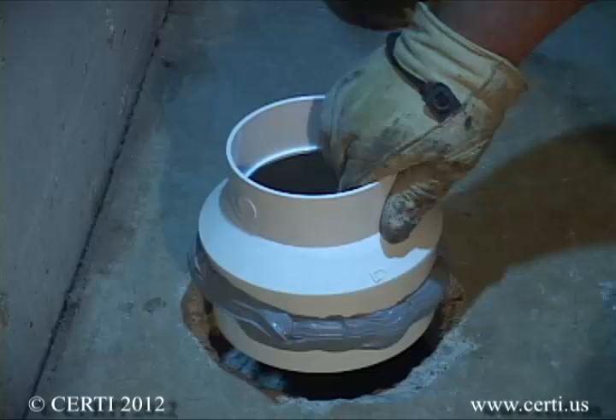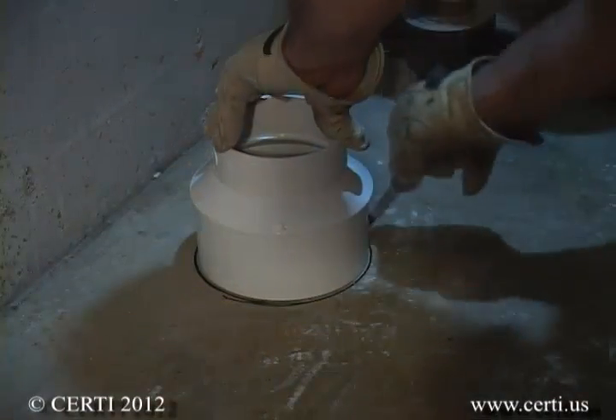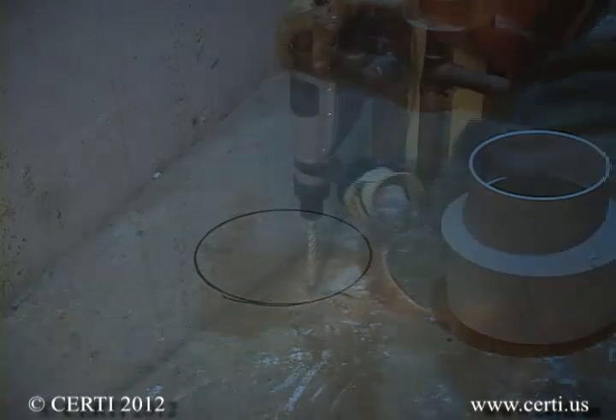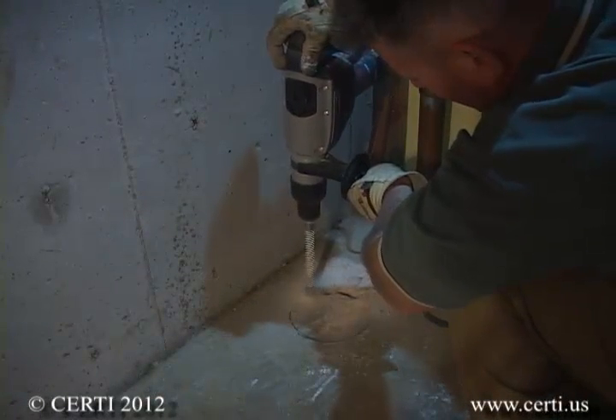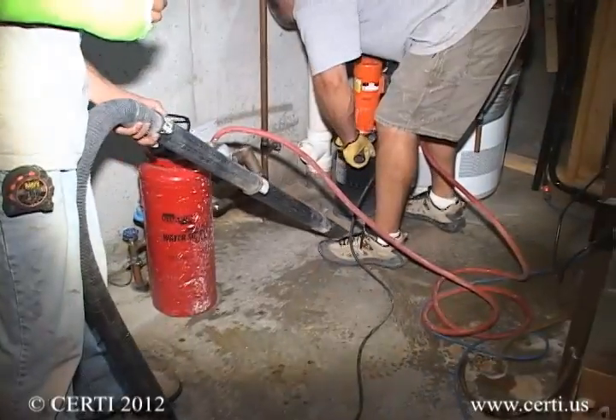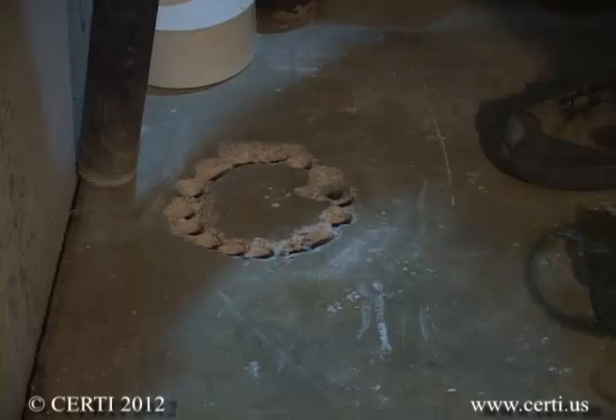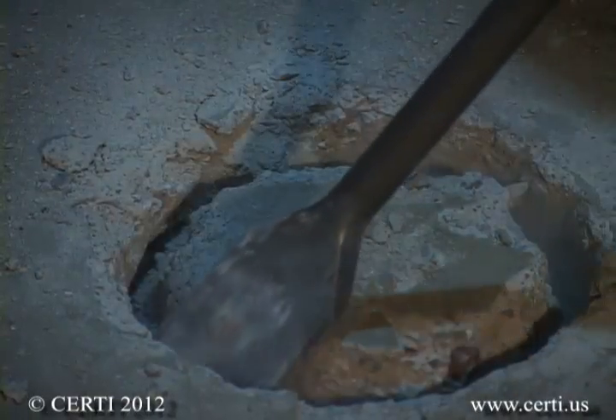The creation of the suction pit is very straightforward, with the floor-to-pipe connection often being accomplished with a 6x4-inch PVC reducing bushing that fits into a 6-inch slab hole and reduces down to 4-inch to accommodate the vent system. To install the fitting, draw an outline on the floor at a point to avoid contacting a spread footing under the slab. Drill the slab along the outline using a hammer drill. A core rig can also be used if you are comfortable with this type of machinery. After your holes are drilled, chisel out the plug and clean up the edges so your reducing bushing will fit into the hole.